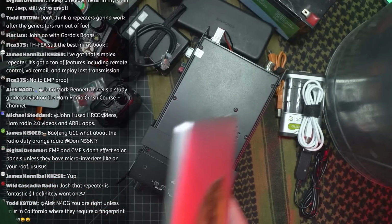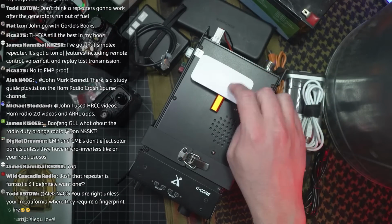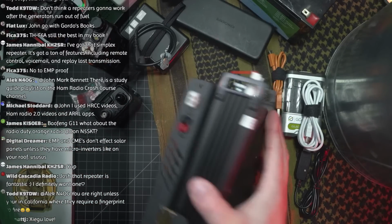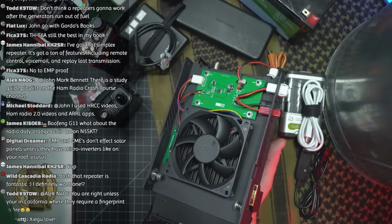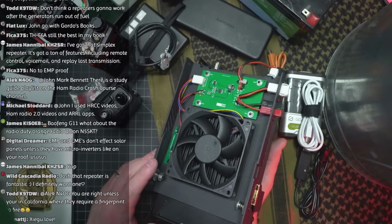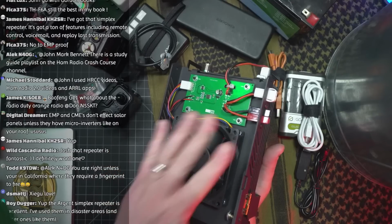I had this up and running in a couple of minutes on the Digi Rig, and then easily with the Raspberry Pi, about the same amount of time, except this is slower. The fan caddy is kind of important if you're going to do digital. This is the old finger chopper version. They have a new version that won't chop your fingers. I think you kind of have to run this if you're going to do power, particularly on digital. You can probably get away with 5 watts, I'm guessing, on digital, and you're going to be fine. You won't need the fan, but there you go.